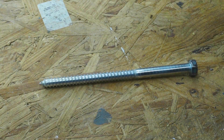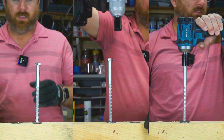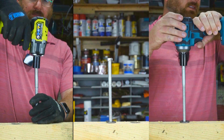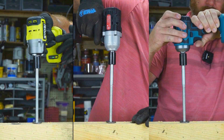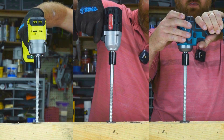The next test: we're going to use these impact wrenches to drive a giant lag screw — eight inches long and a half inch wide. The JSD Hope is on the right, the HyperTough in the center, and the Ryobi is on the left. Take into account the RPM measurements and the power measurements — let's see how that plays out in a real-life test like this lag screw.